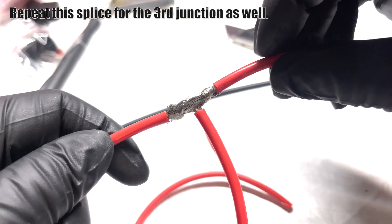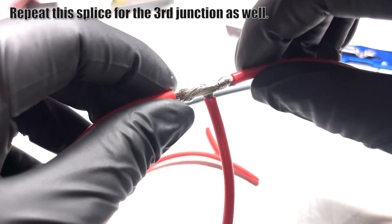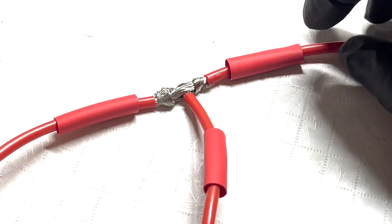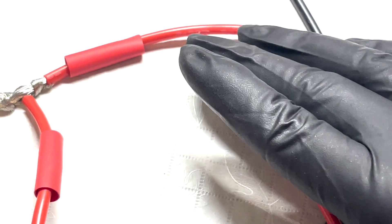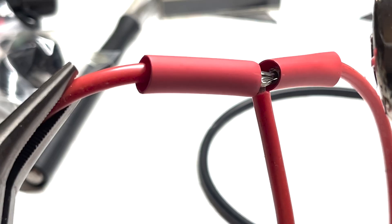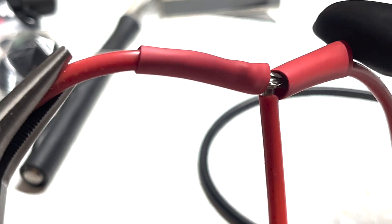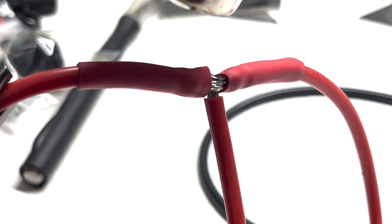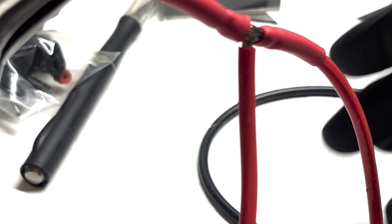It's going to look a little rough, but that's where the heat shrink or tape comes in. I'm going to use some heat shrink on this and tape up the spots that are exposed. One thing to keep in mind when using shrink tubing: make sure you plan ahead and get it to the spots where you'll need it. If you create a crimp somewhere else with your terminals all set up, you're basically out of luck because you'll have to cut the wire to feed the tubing back into the line. That leaves us with a nice little T-junction here.